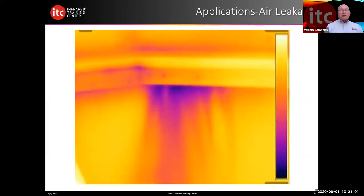Here's a different image — a half-wall basement that is half concrete and half frame structure. Air leakage is coming from where the frame structure meets the vertical sidewall. This is another common complaint I heard in the property inspection business: the basement is always cold and I can't figure out where the air is coming from. You're just assisting people in identifying where those air leakages are.